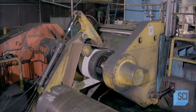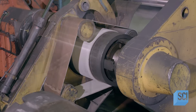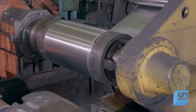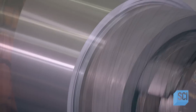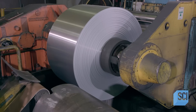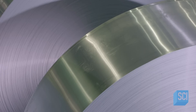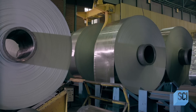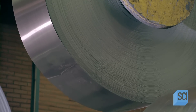The steel belt system maintains the tension in the zinc sheet as it's wound around a core, producing the 46-ton coil of zinc known as the mother coil. Approximately 25 miles of rain gutters can be made from this coil. The workers then slit the mother coil into three; each coil is a foot wide — the correct width to be formed into rain gutters.